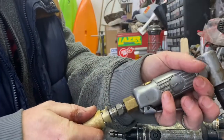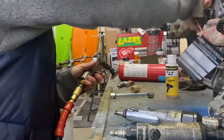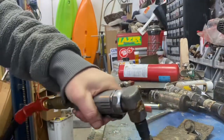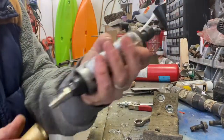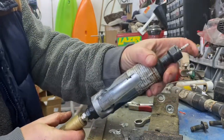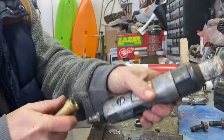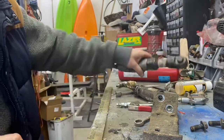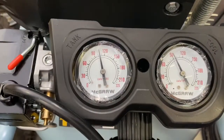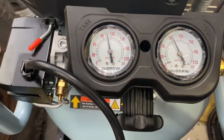Now we can mess with a couple tools. Quick release connection — that definitely feels like it's got plenty of pressure. Let's see if it bogs down. Yeah, that works pretty good, so that's enough cubic feet for that, which means it should be for the die grinder. I have no bit on the end of it — this is a broken bit — but definitely sounds like it's got plenty of speed. Three-eighths air ratchet — tighten. They both seem to work, compressor hasn't kicked on. Air gun. What's that done to our pressures? Dropped our tank pressure from 130 to 105. It ate up some, but let's find out where this tank kicks on.